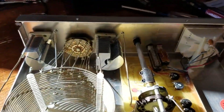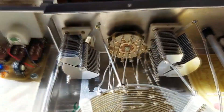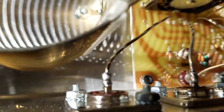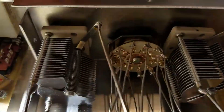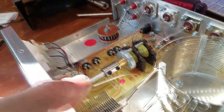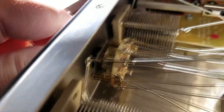Opening this one up — because I just have to see what it looks like inside — the open-air capacitors don't quite seem to be the quality of the old unit, but they work and function very well. I did redo some solder joints. On the inductor selector, when it was new I had to go in and tighten that little nut, and it looks like I'm going to have to do that again. I may just go to the hardware store, put a star washer on both sides of it, and cinch it down.